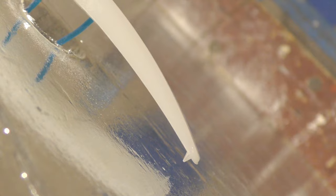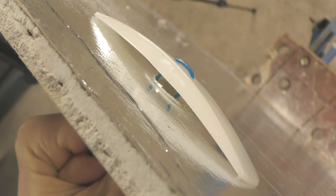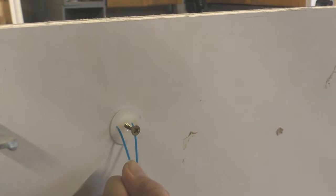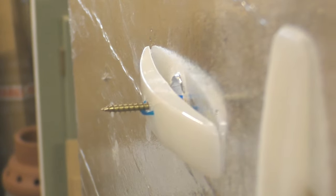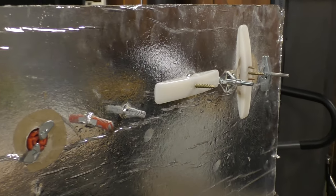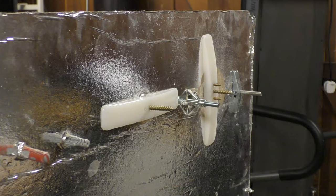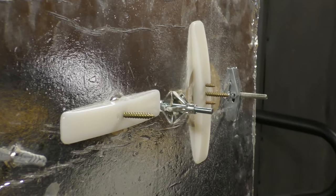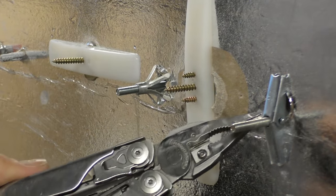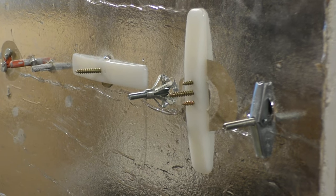The curved part of the fixing has teeth which are designed to penetrate into the plasterboard when you pull the cord tight, so that the curved part does not spin around when you're driving the first screw tight. You can see here just how the Gfix dwarfs the competition in terms of the size of the support behind the plasterboard. Even my previous heavy duty favorites — the wall anchor and the toggle — look quite frankly pathetic when lined up next to the Gfix.